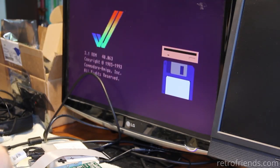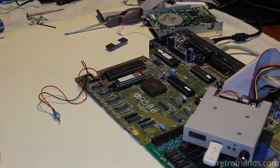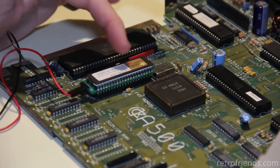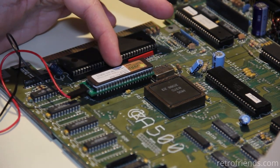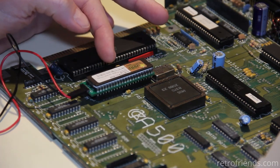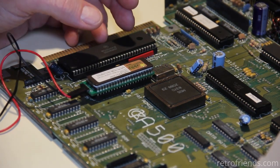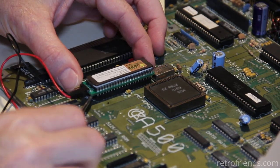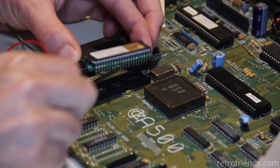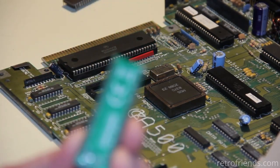The outside pins are a choice between A18 and A19, and that's the only thing it indicates. A couple of possibilities: something's wrong with the PCB, there's a bad connection, one of the pins is floating instead of being pulled to ground, or it's being pulled to ground all the time instead of being brought up to 5V VCC. Since there are resistors there, they're probably pull-up resistors - one for each pin.